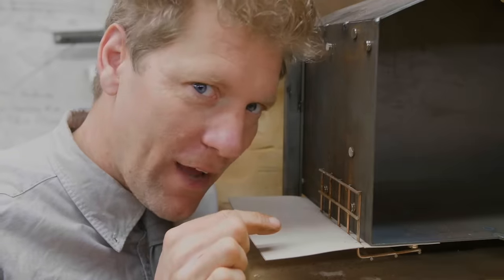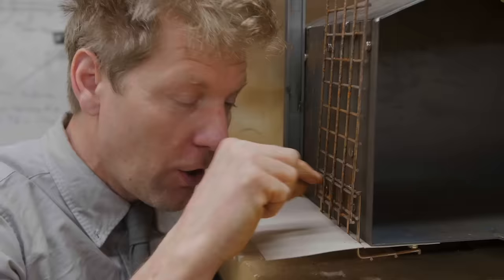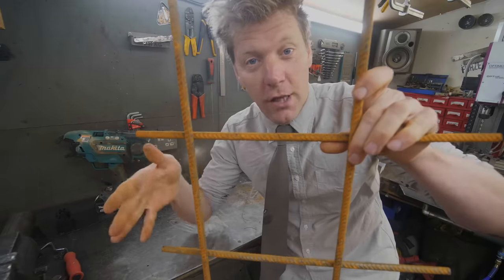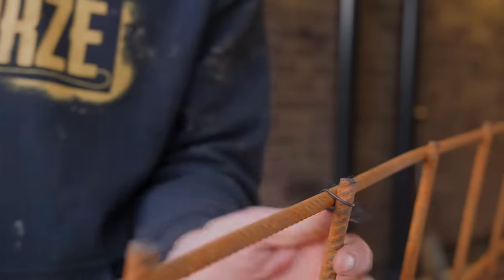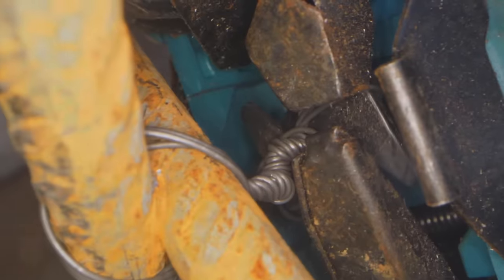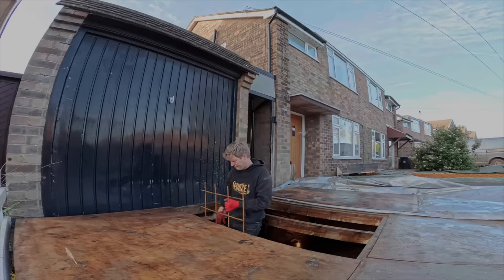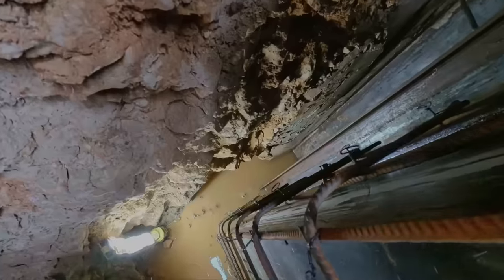This worked an absolute treat — even with concrete flooding around it, it never shifted. We're left with about 400mm of rebar sticking out of the concrete, and the 400mm is important because every time we join our rebar we have to go 40 times its diameter — 10mm gives us 400mm. We bring another bit down, overlap it, connect it, making sure it still doesn't touch the room, and then we need a secondary layer in front of that one. To attach the rebar there are two common methods: old school with a tie wrap, or the modern method — a tie gun. Just put the jaws over it, pull the trigger, and it ties automatically — absolutely fantastic. I then bent individual pieces to tie to the vertical rebar to wrap around the corner to form a continuous mesh.